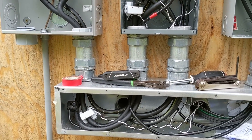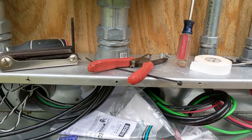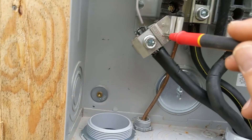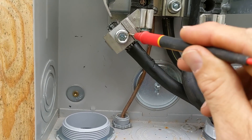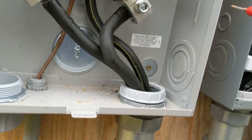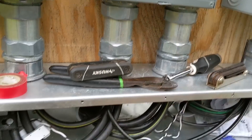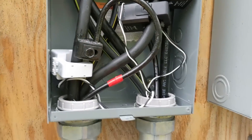Elijah is helping me - we just pierced so we want to make sure we're having good contact here. Touch that terminal. Alright, got it. Now we know we've made our contact and our connections to the grid side, run our neutrals.